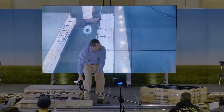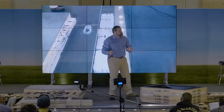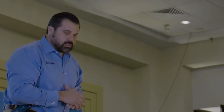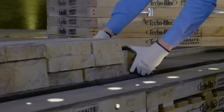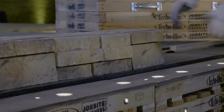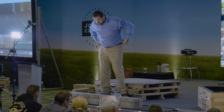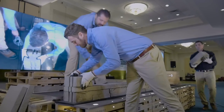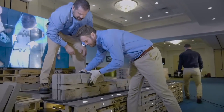So now I have a module of three and a module of two. Let's push our luck — let's do a module of one. We have more B units in this wall system than some of our others, so let's use some of them up. Bring me B, B, one on top of the other, starting with thick and then going thin. We're going to push our luck a little bit with a module of one — our first course is a module of three, module of two, module of one. Now, using the clip, making sure I have positive connection between that previous course and the lightweight units.